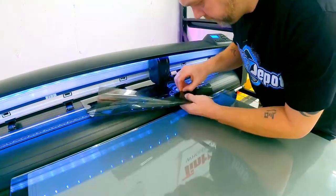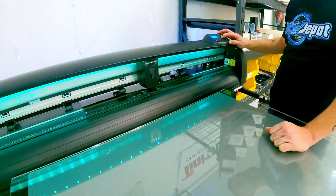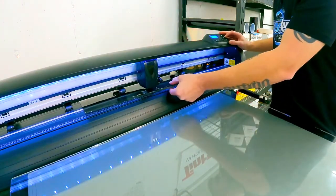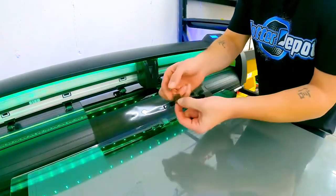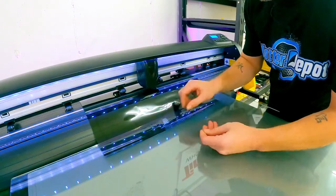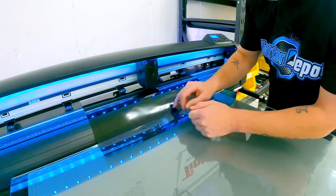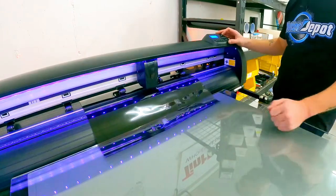That was even better. At 48 I'm going to push the envelope and bump it once more to 51. Enter, then test. Remember, I don't want to cut through — I want it to peel as cleanly as possible. Remember there's a start and stop point even on the triangle, so on the triangle it's on the left wall, and on the square it's on the bottom. When you peel, concern yourself with the right, top, and left of the square — you have to break that tiny little piece on the bottom. On the triangle, break the tiny piece on the left wall, but the rest should peel very clean. I'm happy with that.